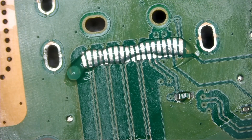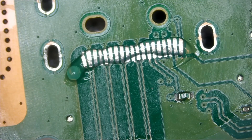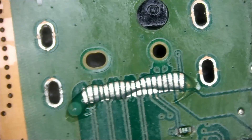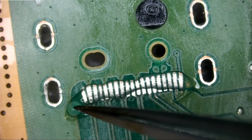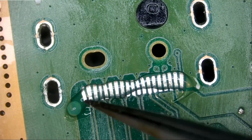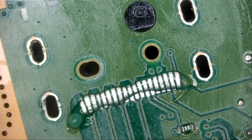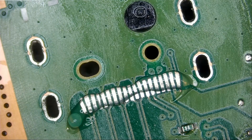I just realized we lost audio on a big portion of the video — I replaced the batteries on my transmitter and receiver and we should be good now. Basically what I did: we desoldered the holes, cleaned the holes, and desoldered the front pads. The front pads are weak — when we desoldered them we just tap over them; we do not scrub left and right. Now that we have flux on the front pins, the next step is to grab an HDMI connector — and that's the fun part.